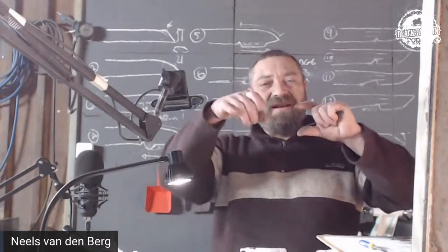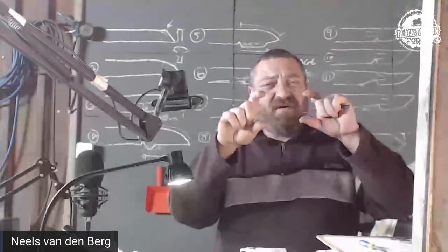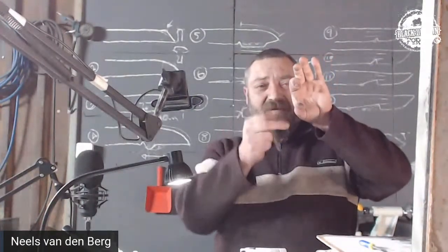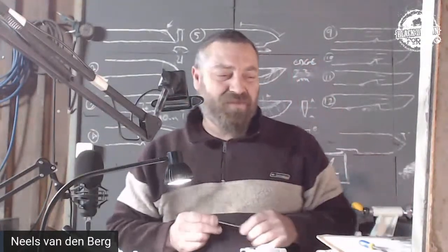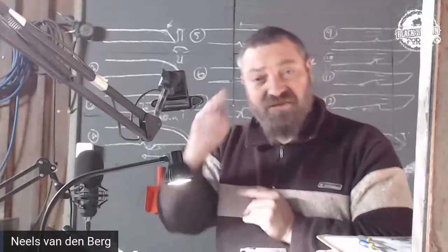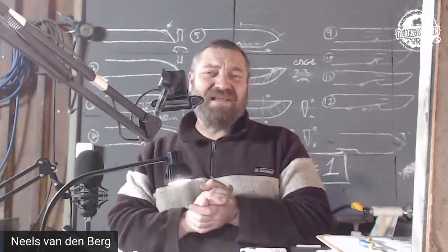But you can go and hexagonal it, you can square it, you can do whatever. So if you want to square it, for instance, you need to do a bit of math and realize that you can't just leave it at 4 mil. If I'm going to square it up, I'm going to sit with a 2-2.5 mil center, which might be a bit weak. So you want to leave it at a 6 mil round to get it to a 4 mil square. So there's a bit of math involved, but nothing that'll make your head sizzle.